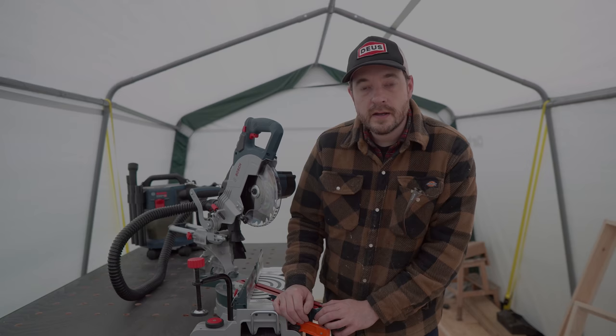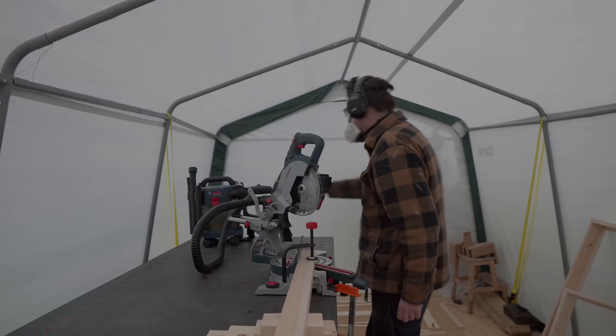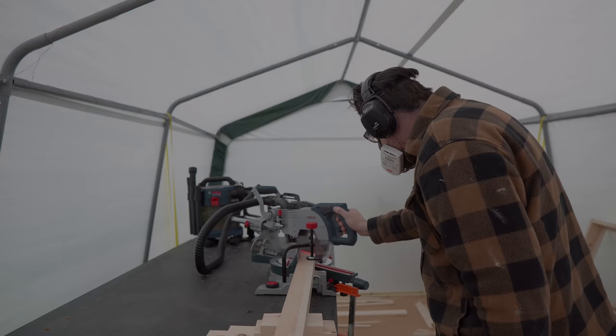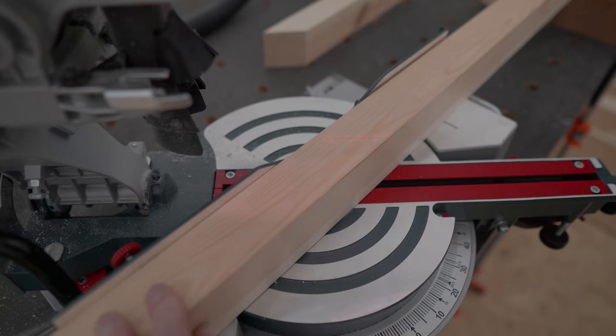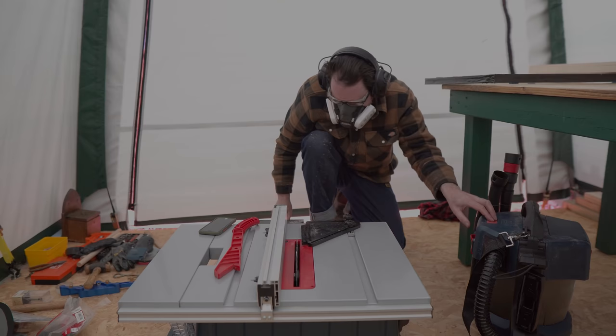I've made three simple non-opening frames. Now I want to make a fourth that opens, so I'm going to frame the glass with some mitres. First I get them cut on the mitre saw before putting the rebate in, because that way I can flip the piece over between cuts and maximize the use of the material. Then I cut the rebate out on the table saw. With the frame laid out I can get the glass on, mark out the size of the rebate, and get that cut.